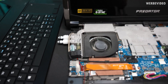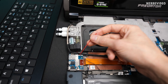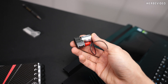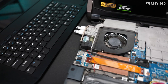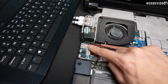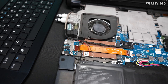There's still some work to do — we have to get current somewhere for our pump. It's a 5V pump, though you can also use a 12V version. Even the 5V pump can be quite annoying noise-wise. But I somehow have to get some voltage to the pump — I would probably use one of the USB connectors and try to solder it on the backside right here. That's something we still have to do.